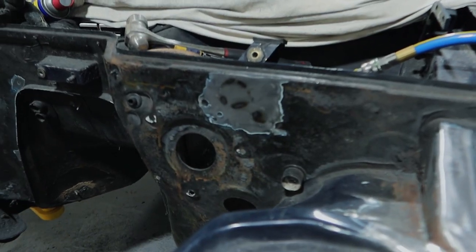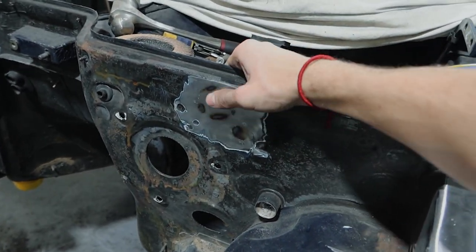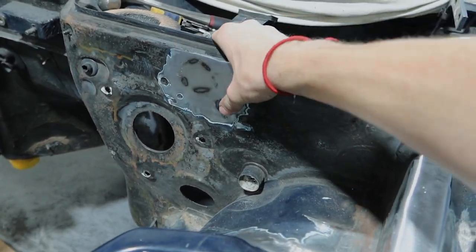The 1.6mm sheet metal is about 0.2mm thicker than the shell, so that gives me a bit more freedom in how much I take off to make it flat. I've welded it in — it doesn't look too crash hot but I'm not concerned because it's not a structural component. There are small holes around the circle after grinding back, but I can just bondo over it. For the other wiring loom holes I'll just tack them since they're not visible — it's only the battery-side hole where the other side needs to be clean.